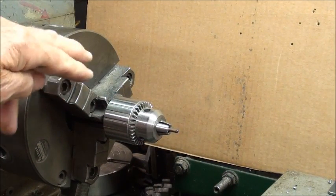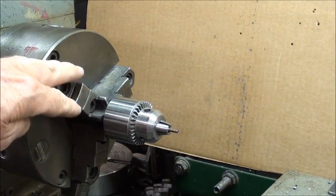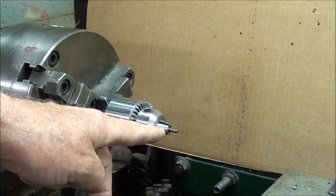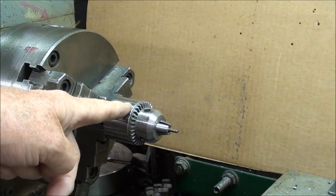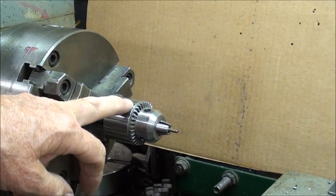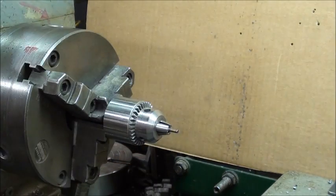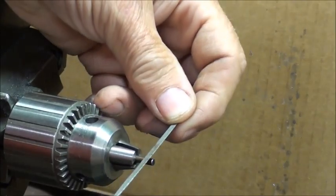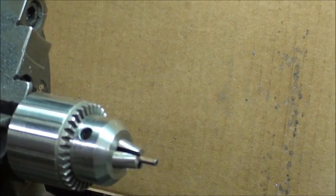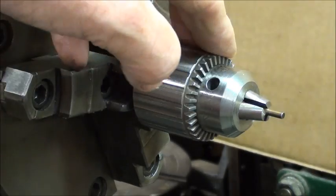Sometimes I hold small round work in the lathe, even for hand operations - I'm not going to turn the machine on. Generally the bigger chucks aren't good for small work and they're in your way. So I like to put a smaller chuck into the big chuck, just a drill chuck, with small work. If you don't have a shank on your chuck, you can also hold the chuck surface directly in the three jaws. These are readily available - you can buy old drills at garage sales for a dollar and just strip the chuck off. This is a real good way when you're going to file or shape something, and you can also rotate it into different positions. The use of a collet rather than a chuck, if you own collets on a lathe, is a wonderful way, and the collets will not in any way damage a thread if you're working on a threaded piece.